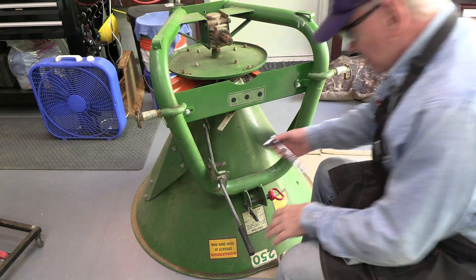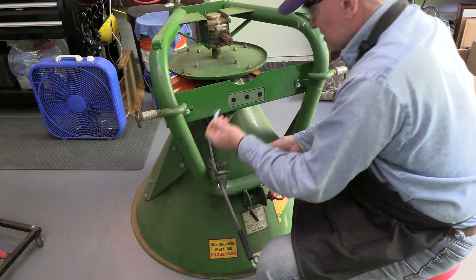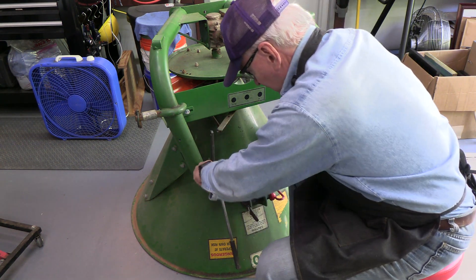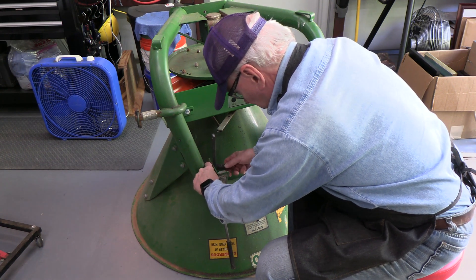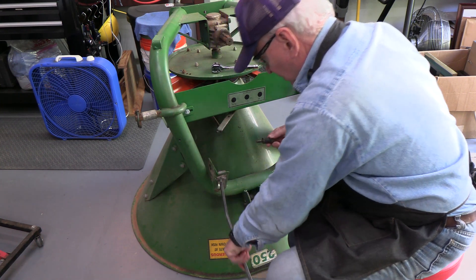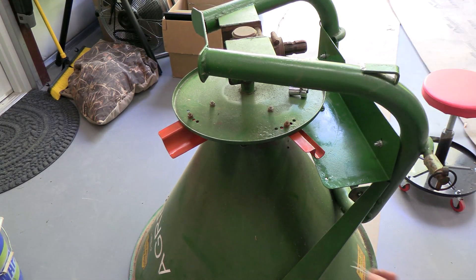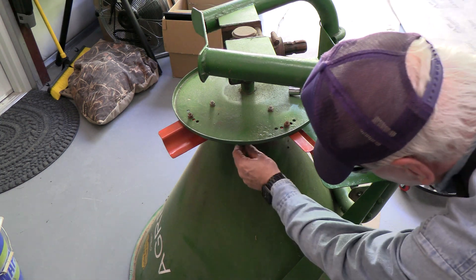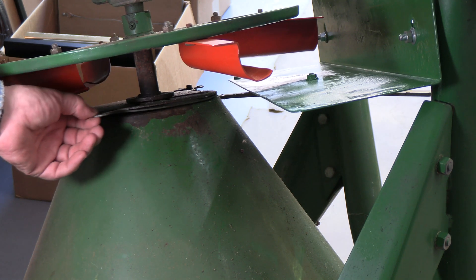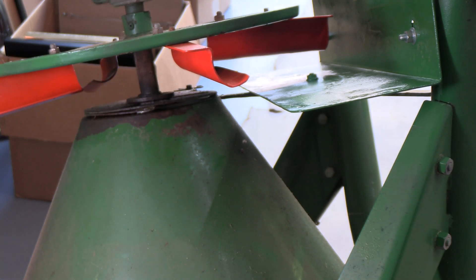So the first thing I'm going to need to do is to take this apart. I can take this hitch, this pin off, and we'll take the arm off. There that is. And then we'll take the pin off this other — and there's the connecting arm. And now we've just got this that we've got to worry about. So we can see the connection to make this gate open and close, and that's what we're going to connect to our actuator.